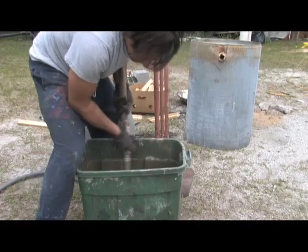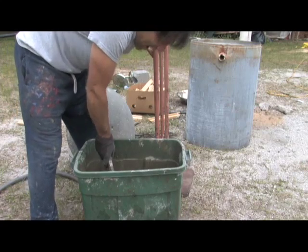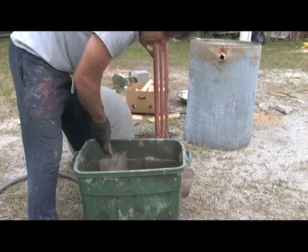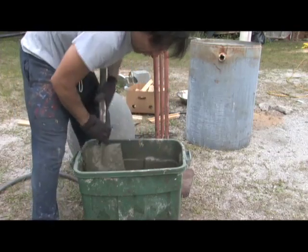It's good to do this in the evening time — let it set overnight. You don't want the sun on it because the sun will dry your concrete too fast and you'll get cracks. It's best to wet your project down as much as you can once it starts to get a nice hardness to it. Wait until it gets almost hard to the touch and keep wetting it. That makes your concrete set stronger.